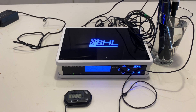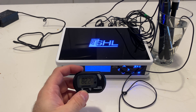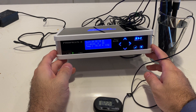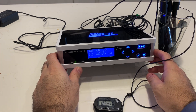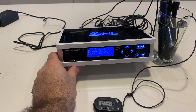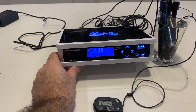Pop that in the water. The next one is the temperature sensor. I recommend picking up one of these digital thermometers — right now it's reading about 82.2 and the GHL is reading about 79-80, so it's a little off. The only way to actually fix this is to plug the GHL USB into your computer and use the GHL configuration software, which also works through IP if you know the IP address. We'll go over the Windows PC software in a different episode and show how to do the temperature setting then. This is how you calibrate all the probes on the GHL — it took me roughly 15 to 20 minutes to do all of them.